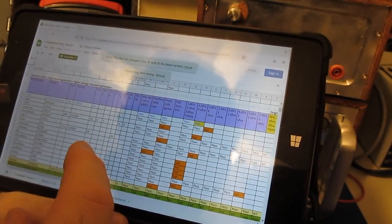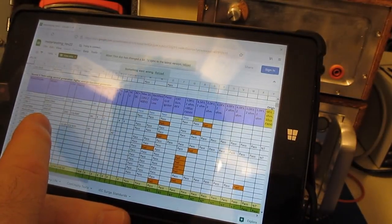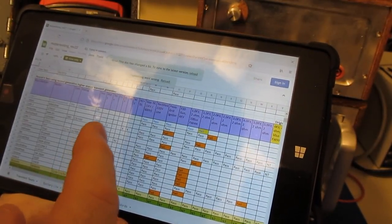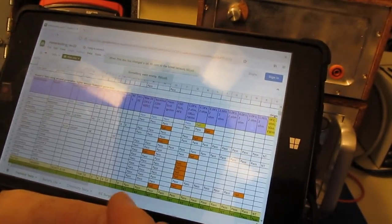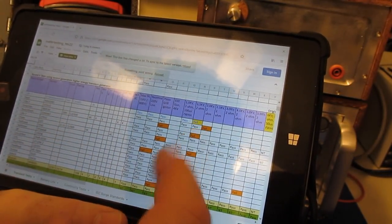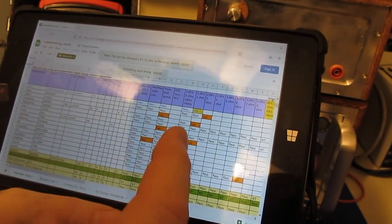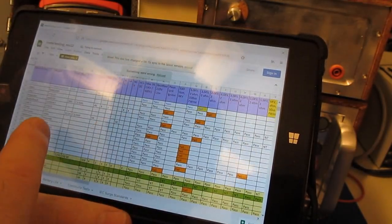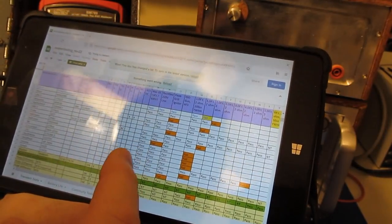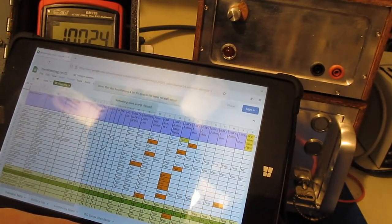So kind of go through the more recent tests. It looks like we had the UNI-T UT61D, that failed the piezo grill starter. The UNI-T UT61E, that failed the piezo grill starter. The Klein MM2000, that failed at 2000 volts. We have the Amprobe AM530, that failed at 1.5 kilovolts. We have the TechPower TP40, that failed at 1.5 kilovolts. We also have the TechPower TP2844R, that failed the rectified AC line test. The BK2705B, that failed at 1000 volts.